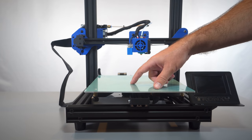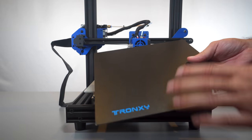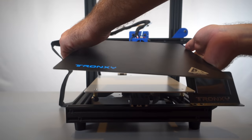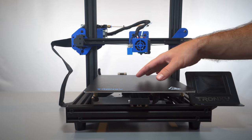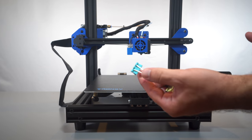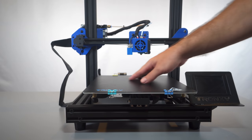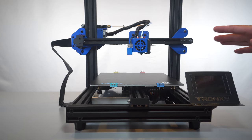Peel the plastic cover off the aluminum, then grab the top surface — which has a BuildTak-style material and appears to be fiberglass. The cool part is it's flexible: when you're done printing you can pop it off and flex it, and the print pops right off. Align it with the aluminum part and attach the four clips — which are different colors, just the way Tronxy does it. To remove prints, pop the clips off, take the bed out, and flex.